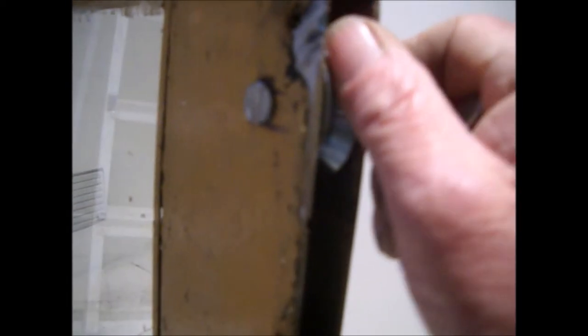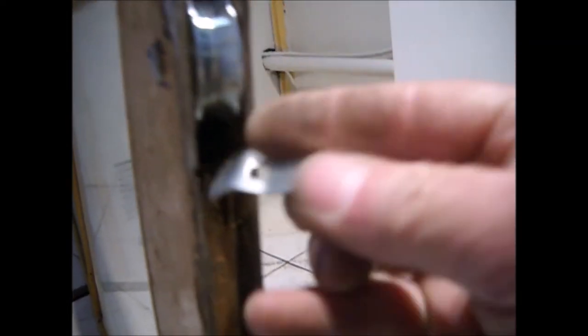And now I have to weld them in such a way that the wheel can turn on its ball bearing, but not the shaft. So, I must place a thin wedge here, so the wheel stays centered while I'm welding. Like this. Now I can weld in such a way that the wheel can turn without touching the steel sides. There we are. I finished soldering.